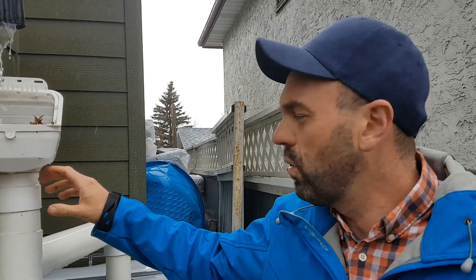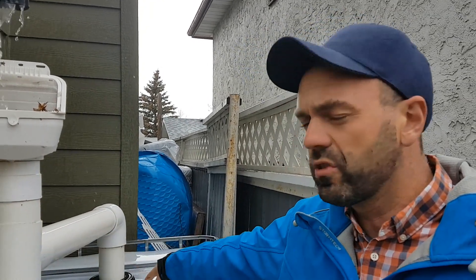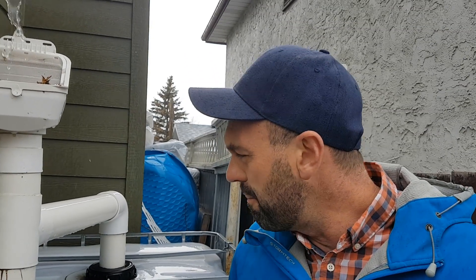In an ideal world, we'd skip the first flush diverter and go straight into the tank itself. Any debris left in that water is going to settle out in the sludge layer or get picked up by the biofilm layer. The main reason you don't want to use one of these is that there's no real good evidence indicating it improves the quality of water coming off the back end of a rainwater tank. If there's nothing to prove it's improving the water, you're wasting money and wasting water.